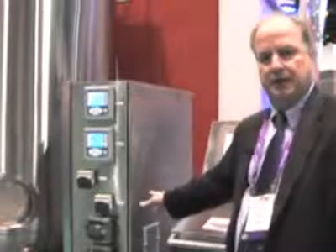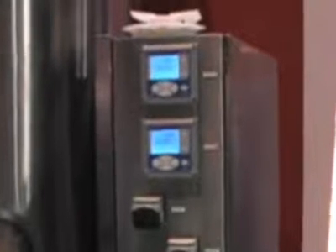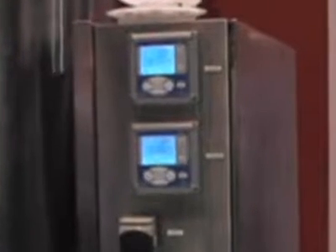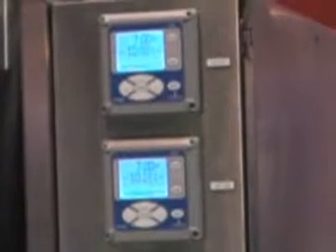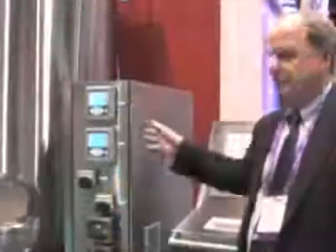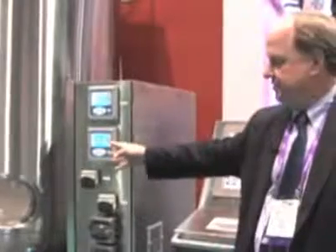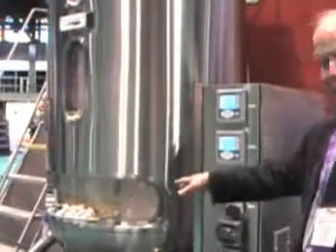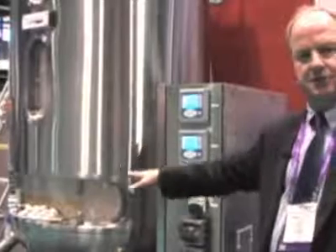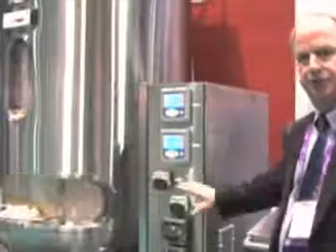This instrumentation panel houses all the transmitters for pH, dissolved oxygen, temperature, etc. It also houses the mass flow controllers for the gases that are fed into the bioreactor to supply oxygen and to remove CO2. Through this instrument panel the sensors are then connected to the bioreactor itself, shown on the left. When the reactor is fully installed, the sensors are inserted into the plastic liner at the line of the probe ports, and then those sensors are connected to the instrument panel.